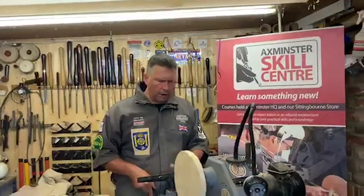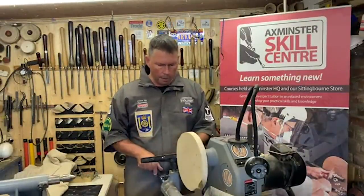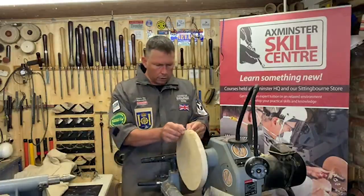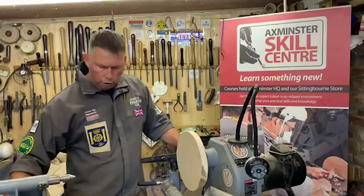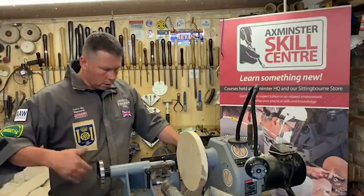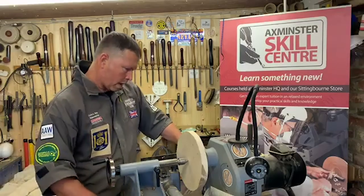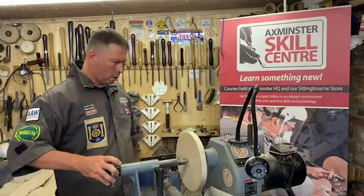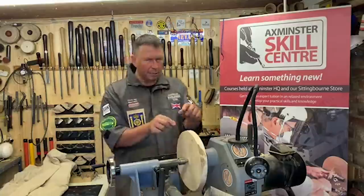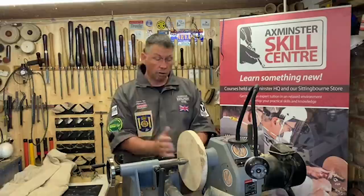It's a very thin piece, probably about 25mm, and it's also warped, there's a bit of ripple in there. So it's going to be a little thin plate. I've only got fairly shallow screws in there, so I'm going to start with the tailstock in place, just to give myself a little bit of extra security. There we go. This is going to be the back. I'm going to take some of the diameter away, I think it's a little bit too big, so we're going to take some of that away and create a foot.